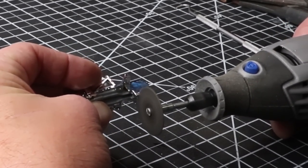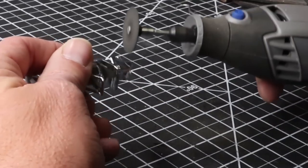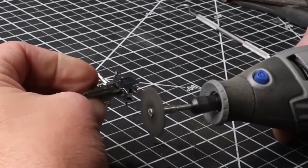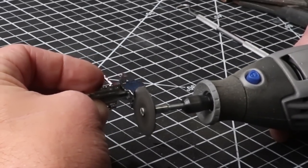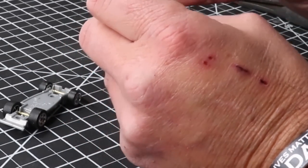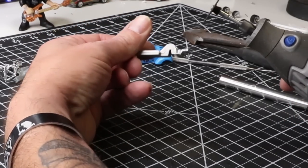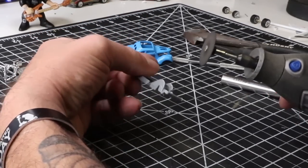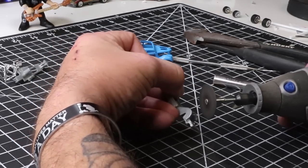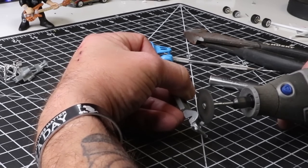The interior, the one section of it there in the front, the rear actually holds, the tabs hold it in, but it actually rests over the axle. So with the axle tube, I need to make it a 16th all the way around, so an eighth inch bigger, so that it fits flush. That's another thing that I've made the mistake of, not doing that and then trying to put it together and wondering why it's not fitting.